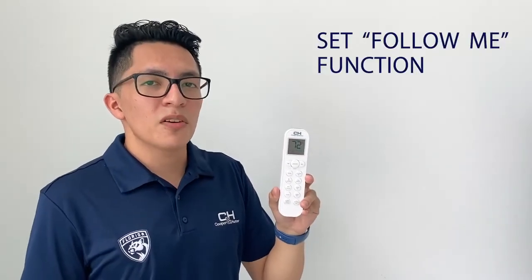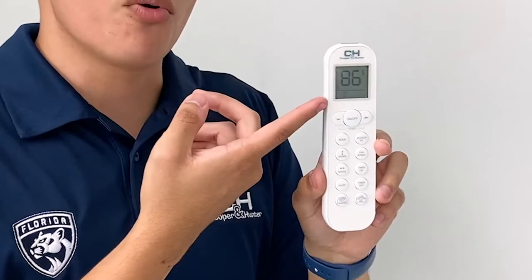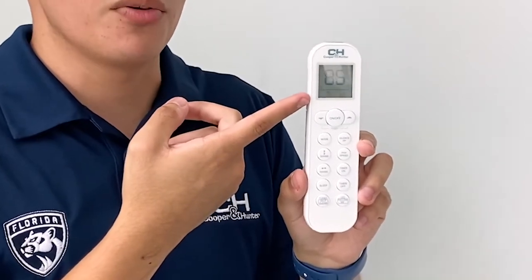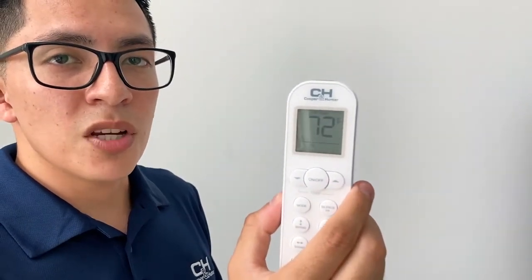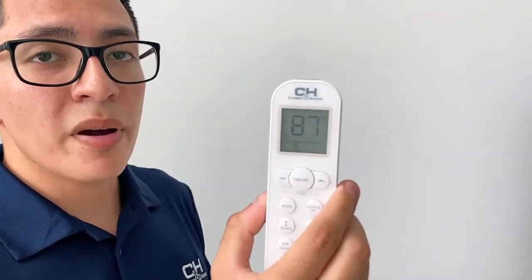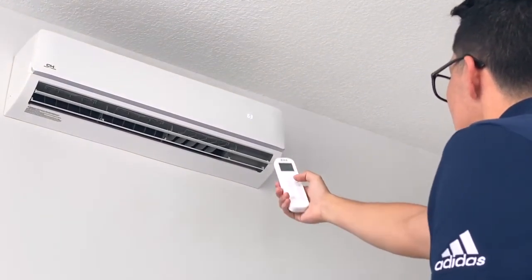To set the follow me function, press and hold the follow me button. An icon will appear on the remote to let you know that the feature is activated. Once this feature is activated, the unit will read the temperature around the remote. You will also see that the remote will show the ambient temperature around the remote. To set the temperature, press the up and down arrows. You will see that the temperature on the remote changes to the set temperature. It will jump back to the room temperature. The indoor unit will also show the set temperature.